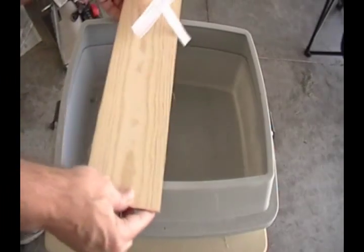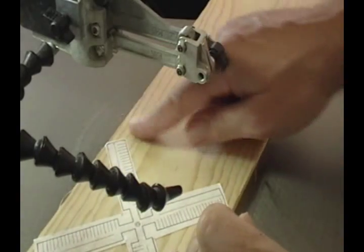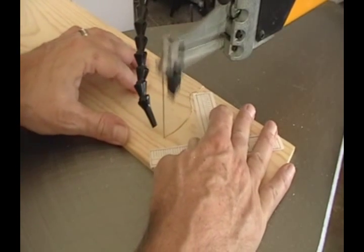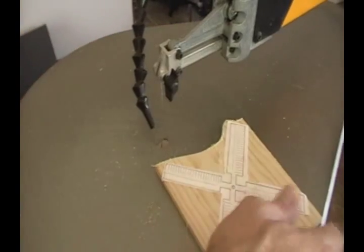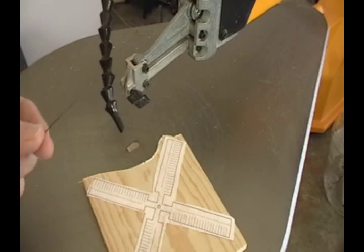We're going to get started. I'm going to glue and fasten the template to this piece of wood, and then I'll be set to start cutting. For the initial cut I'm going to cut this down to a smaller piece so I don't have this big clunky part in the middle of my work. I'm going to use a number three Olsen scroll saw blade — it gives me more control and I like the style of the cut better than the larger number five, which cuts through like butter.